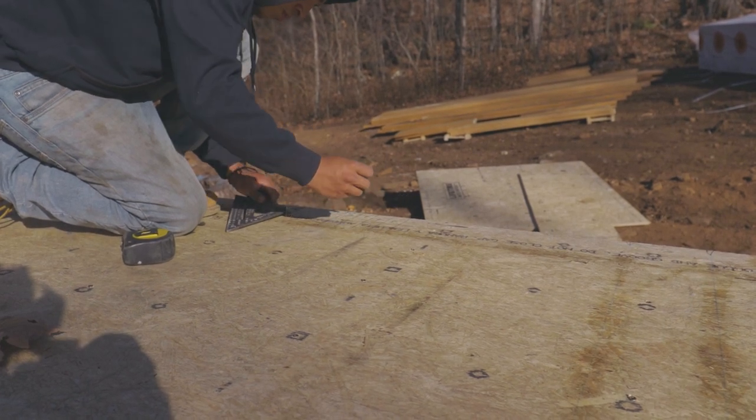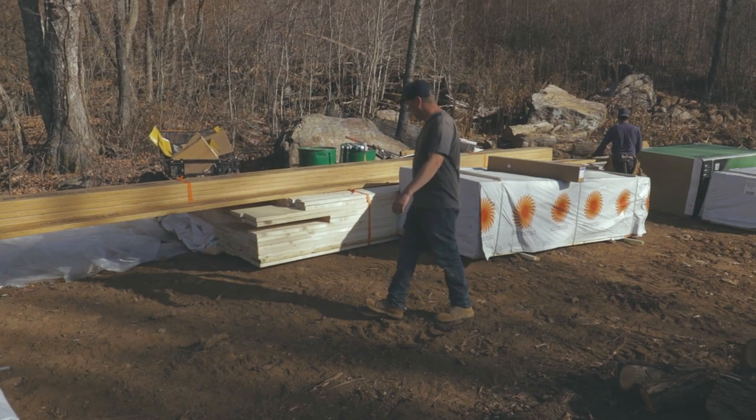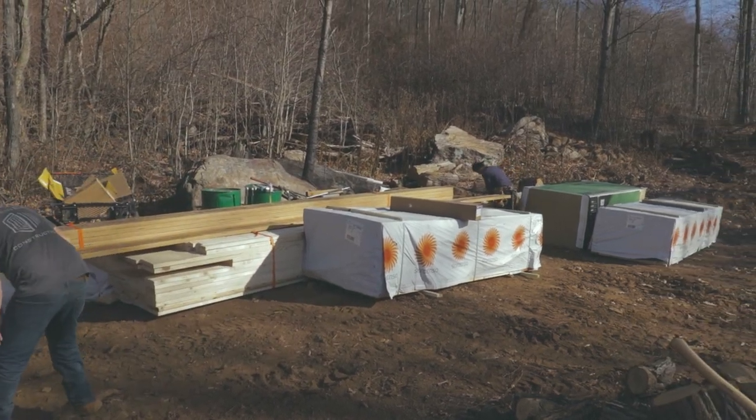In this case, we had a little bit of error in our floor systems, and I believe we pushed the error into our coat closet area. Really, what you want to do is stay away from any rooms that have cabinetry or countertops. You don't want any countertops to be out of square in the corners. Once the layout's complete, we'll begin building and standing our walls.